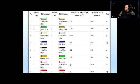Let's look at the Cat5e. Blue pair, so orange pair. It's listed as transmission data or receive data. Okay, so here's a pair for Cat6, Cat5e A. So here's the green white, or the stripe, would be transmission data plus, and the solid green would be transmission data minus, which would translate into a tip and ring.